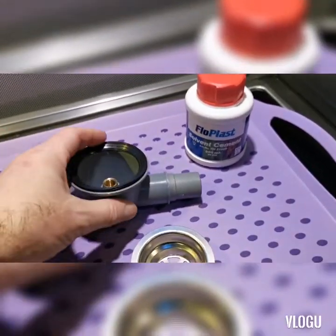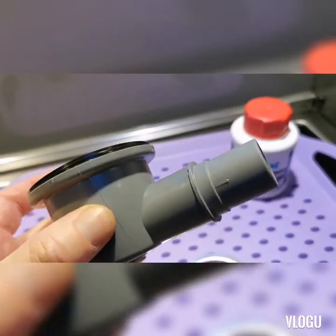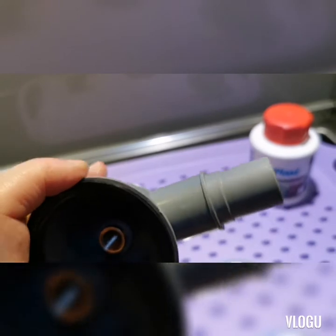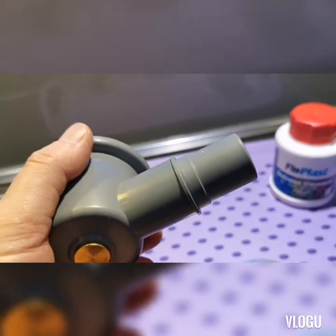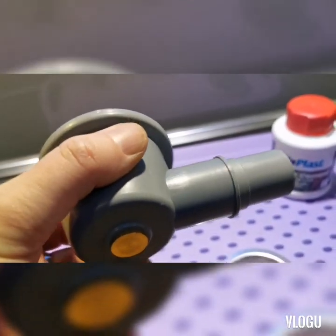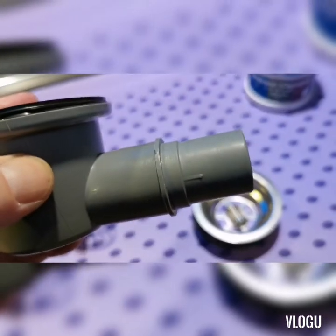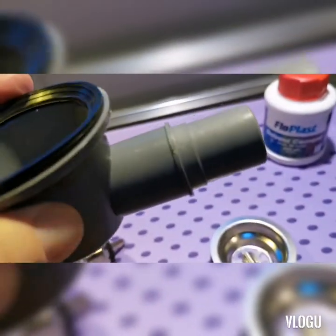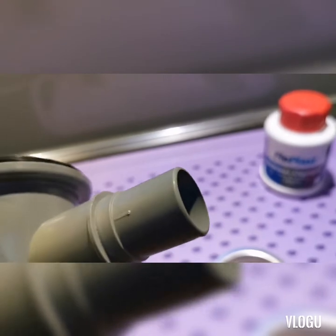Quick update: the reducer you have to buy is a very tight fit in the housing. I warmed the housing up with a hairdryer to make it more pliable and managed to push it in by hand. I've taken it back out, let it cool down, done the same again, but this time I've put solvent cement on it. I'm not sure whether it actually melts this plastic, but I can't get it back out, so I'm guessing it does to some degree. I'm going to put some amalgamation tape around the top where it joins just in case.